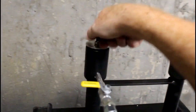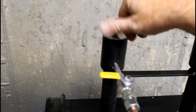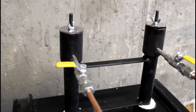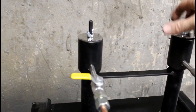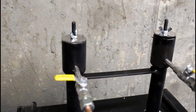These are the valves. This is a 2-burner forge. I usually only use 1 burner. Unless I'm doing a really large knife, I turn off the back burner. So in this position, the front burner is on, right there. The valve is parallel to the fuel line. And whenever that is on, you want to have the corresponding choke open.